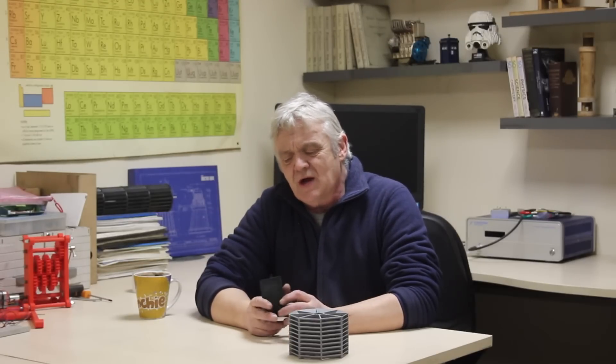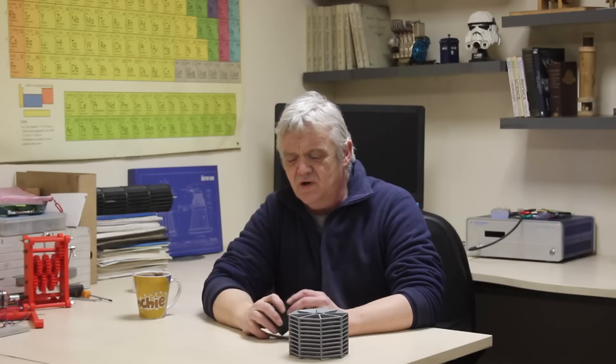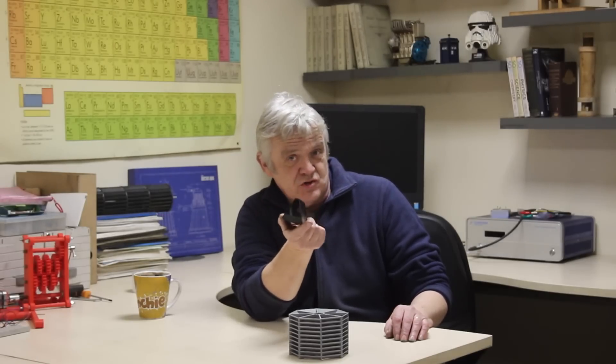These have been printed at 35 degrees, and you'll notice they're basically flat panels — the louvres are flat. I like flat panels because they're easy to make. I've been running these models up with a 3D printer, but I fully appreciate not everybody has one. This is just flat panels — you can make this out of card if you wanted to, which I really like. I do like the Envelux design and hyperbolic funnels — if you've got that ability, knock yourself out. But flat panels are something everybody can do with a minimum of engineering.